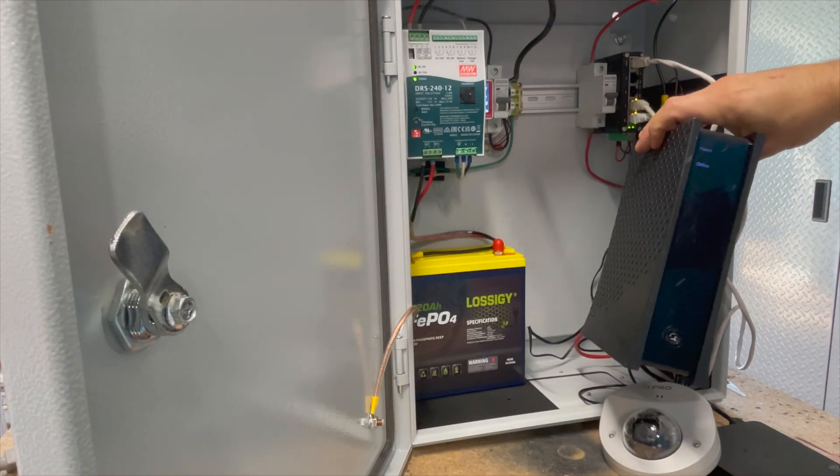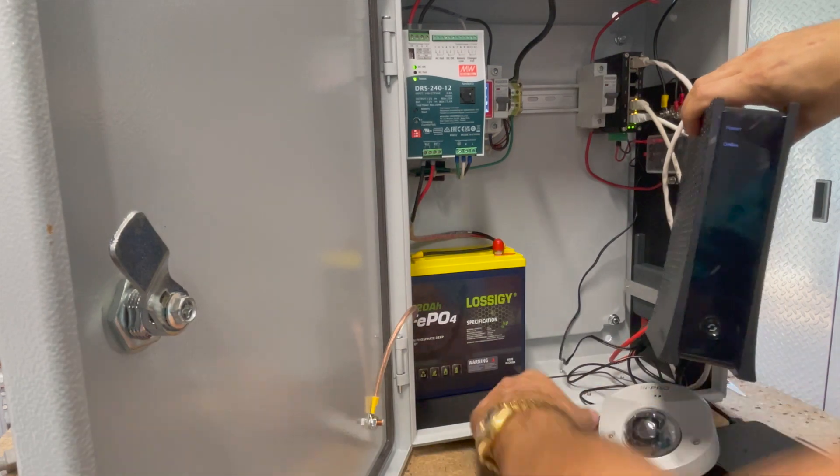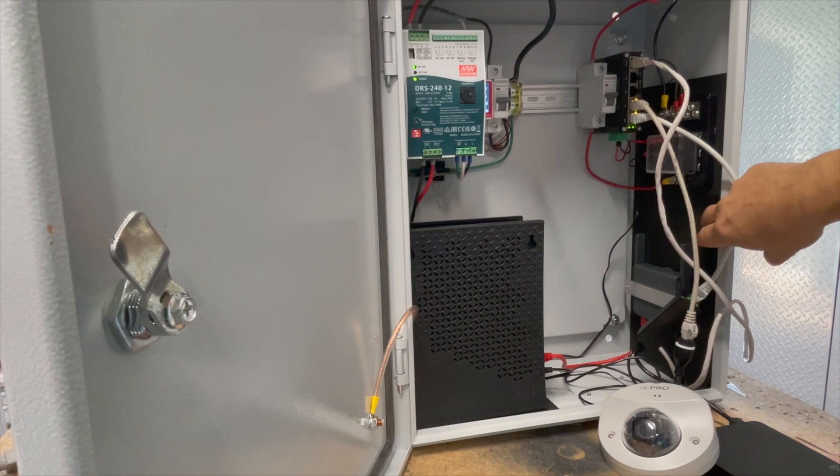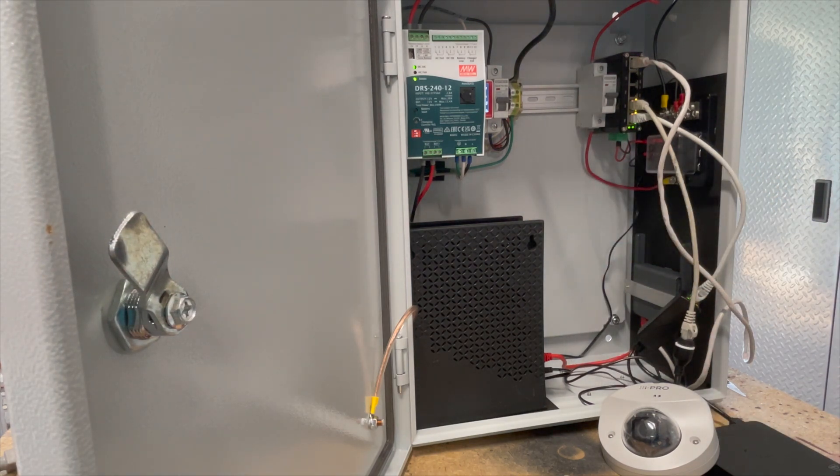The lithium iron battery is hiding behind the cable modem. Because the base was uneven, I added a piece of King Starboard to create a flat surface for components to rest on, and another piece on the side to bolt other components to. That leaves plenty of room for the small PC for the cloud VMS bridge. Once closed up, it should be pretty weather-tight. This is being installed in Florida and for the most part has no fans — with some sun load, temperatures stay manageable. I've also been finding Peltier-coupled cooling systems work better here. Since it's going in a waterfront location just feet from open salt water, I really prefer keeping it environmentally sealed rather than using vented NEMA enclosures with fans circulating outside air.